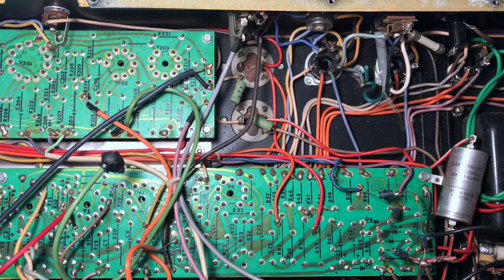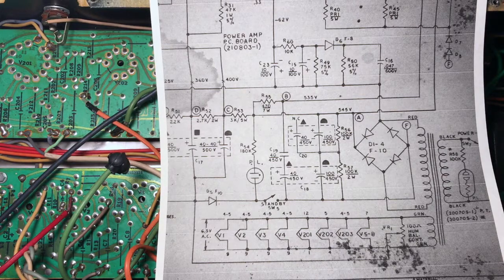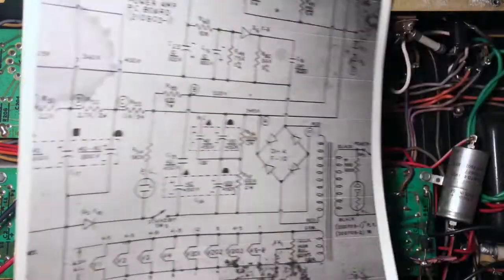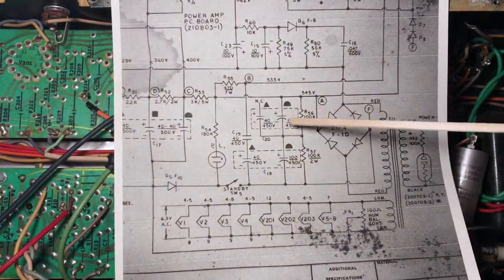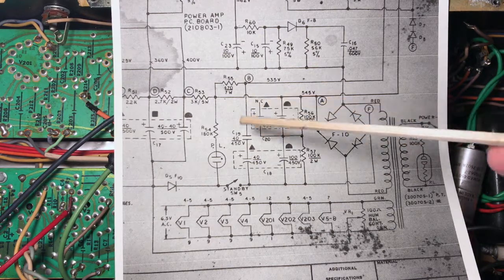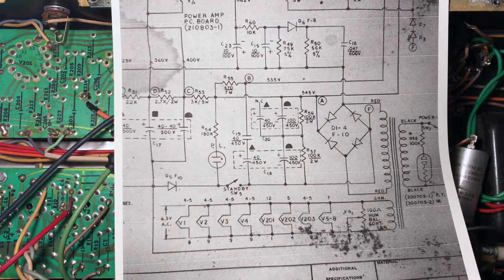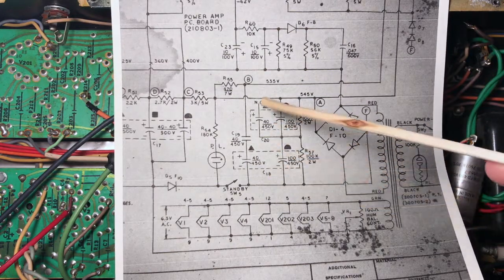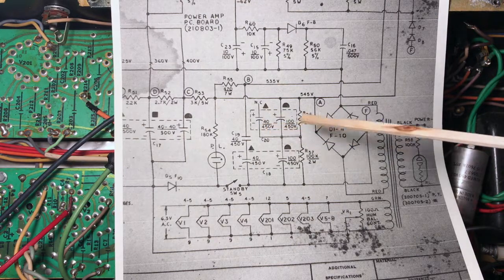But you say to yourself, if you needed two 40 microfarad capacitors in series, and you've got one in each of those cans, why aren't you using those in series? Well, here's the problem. Since the 100 microfarad capacitors, one in each can, are connected in series supplying the voltage for the A node, this bottom half of the capacitor can is not at zero. It's halfway at that 545 volts. This cannot be shared in series with two other items. In other words, you couldn't connect this to this because it would be sharing a voltage. It actually would be part of that circuit.